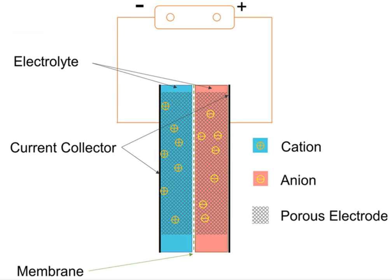Comparison of selected commercial supercapacitors. The range of electrodes and electrolytes available yields a variety of components suitable for diverse applications. The development of low-ohmic electrolyte systems, in combination with electrodes with high pseudocapacitance, enables many more technical solutions. The following table shows differences among capacitors of various manufacturers in capacitance range, cell voltage, internal resistance (ESR), DC or AC value, and volumetric and gravimetric specific energy.